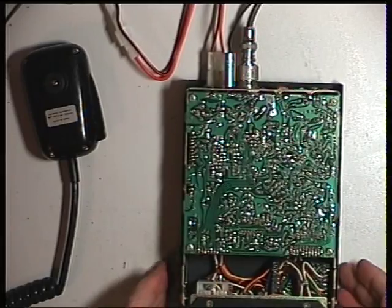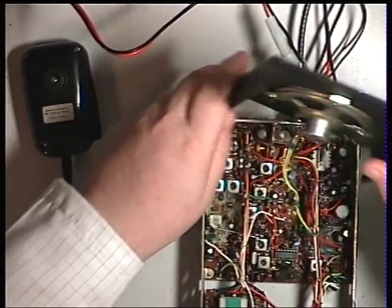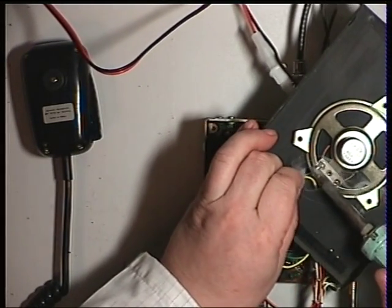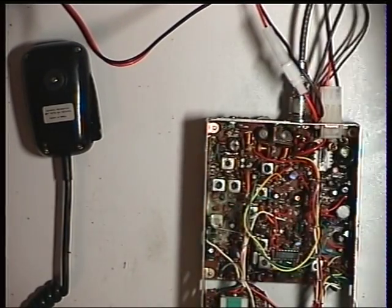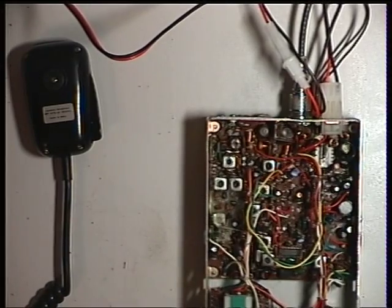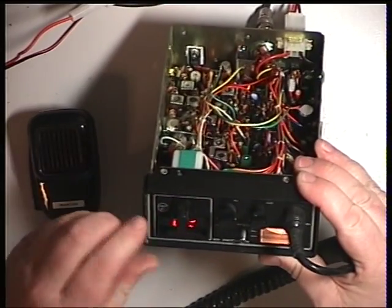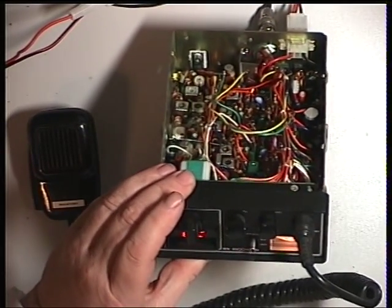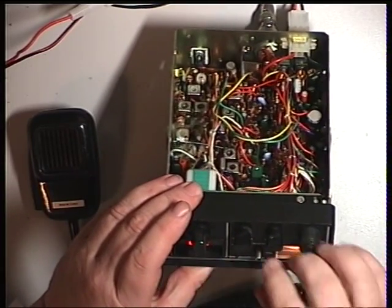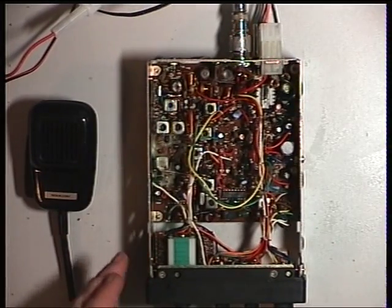Well, that looks pristine inside, and there's no nasty surprises either. We've just unsoldered the speaker lid — nothing worse than having that floating around the workshop. Switch it on. Light on. We'll select channel 20, which is clearly receiving because I've got the signal generator on. So we'll proceed now with what the manual says to set the VCO.